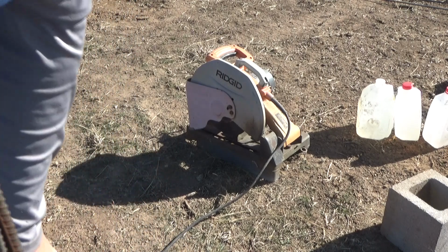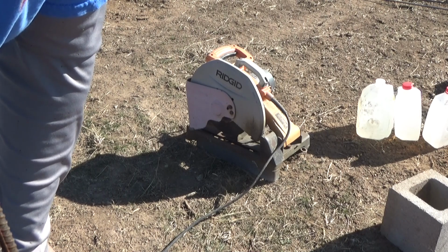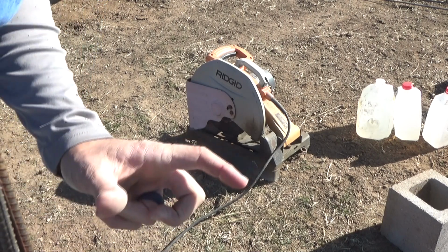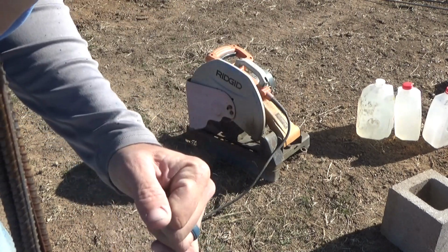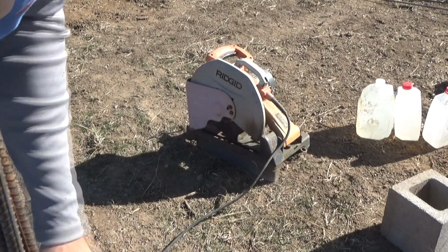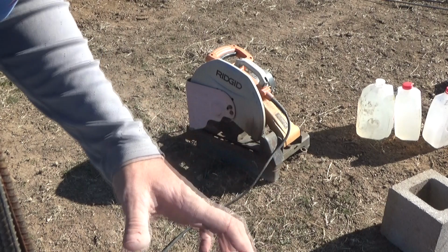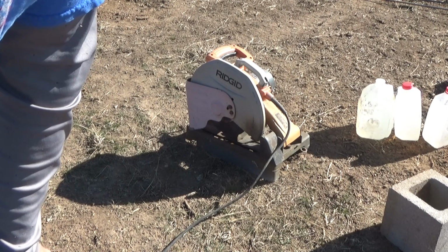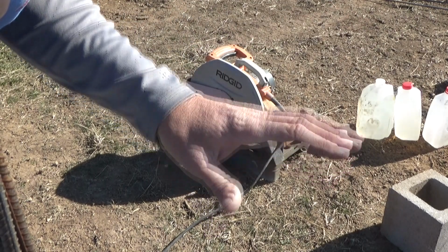Another thing that I'm going to do is I'm going to measure these, and I'm hoping to end up with about, I don't know, 8 inches of rebar sticks. But then I can drill a hole in the top and embed that piece of rebar in with the adhesive, and then flip it back over and set it on all the wet concrete, because I'm going to set these tops where everything's wet. Not the mortar joint, sorry, but while the concrete filler is wet, that's when I'm going to set the top, and I'm going to have at least 3 and probably 5 pieces of rebar sticking out of the bottom of the top, adhered into place, and make that connection from the top to the columns.